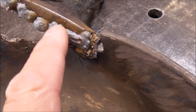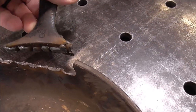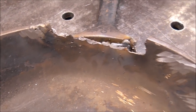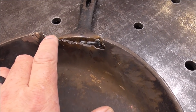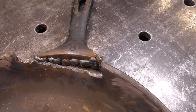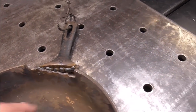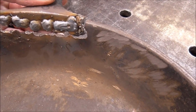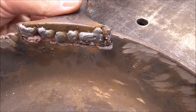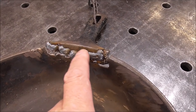One of the first things we've got to do is get this weld ground back down so the part looks like it did before it was welded. Each time we repair this, we're changing the grain structure a little bit, probably making it more brittle by adding heat in the heat affected zone. Cast iron is brittle and difficult to weld because of its high carbon content. We'll be doing this with a preheat today and I'll explain why as we go.